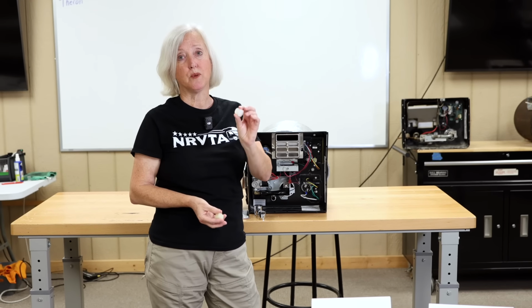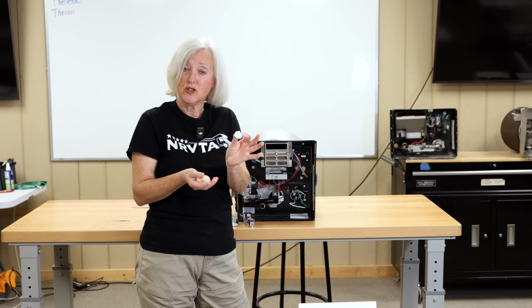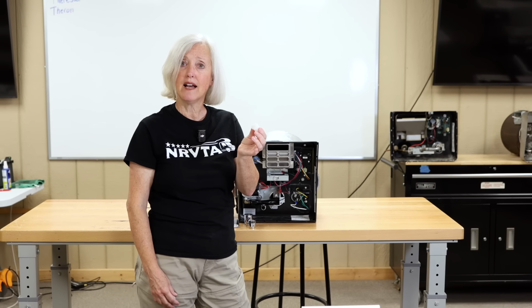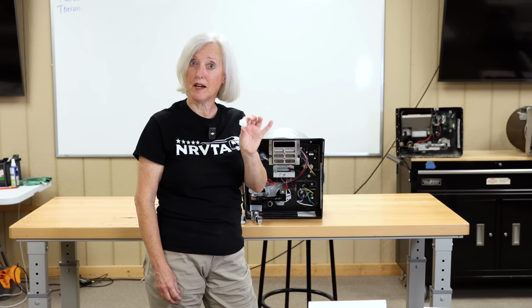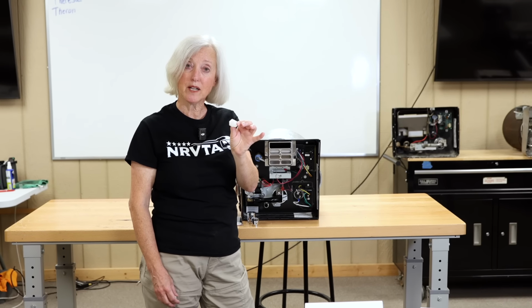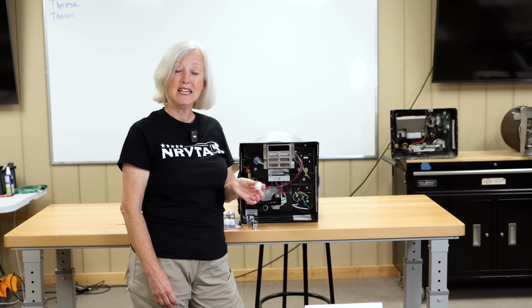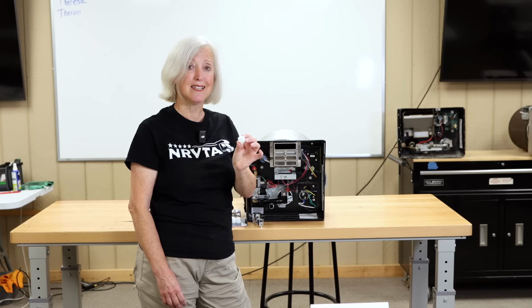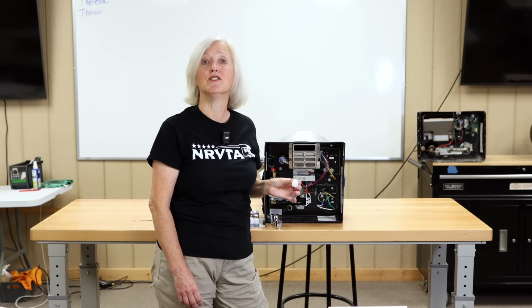It's also really important what this is made out of. You'll see it doesn't look like much. It's very unassuming, so a lot of RV owners will look at this and say, well, I could do better than that, and they'll buy themselves a metal drain plug. If you put a metal drain plug into an aluminum tank, you have two dissimilar metals, heat, and pressure. You can have galvanic corrosion, and when that happens, that metal drain plug is going to get stuck in the tank, and you're never going to get it out.